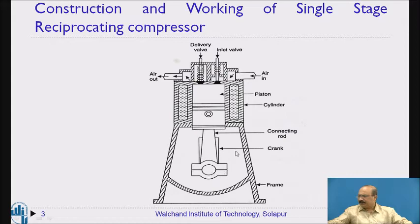The crank and the total frame is fixed on the frame support. Here is the connecting rod, and this one is the piston and piston cylinder. The inlet air is coming through this side, and the inlet valve is provided here, which operates with the help of a spring. This is the delivery valve, and here is the air outlet — the outlet of air takes place through this point. This side is inlet and this side is outlet.